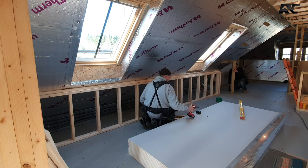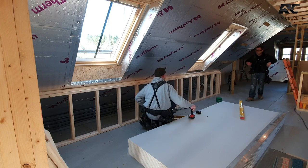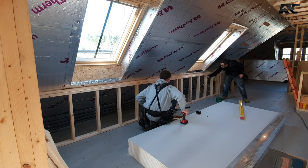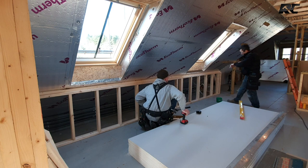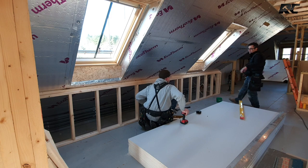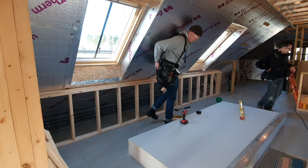That's it — great. Now we are ready to do the rest of it. That was an easy way of fixing the walls: make them up first downstairs like ladders, cut all the studs the same way, put the angle fillet in, screw and clamp that into the wall, plumb it up — job's a good one, happy days!